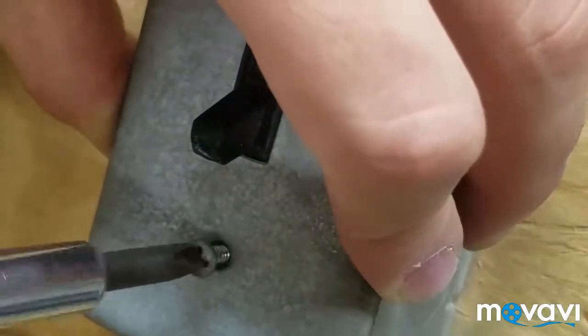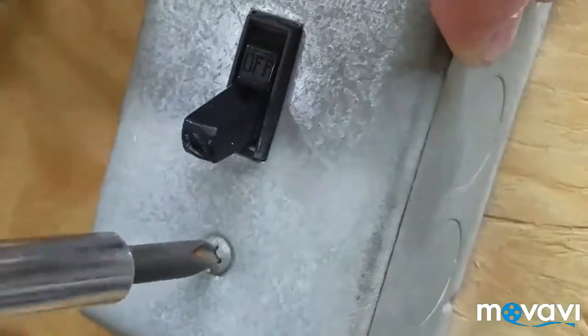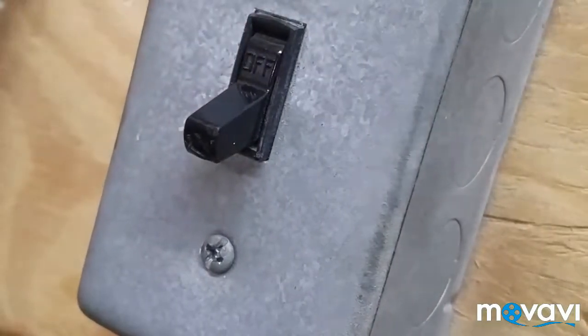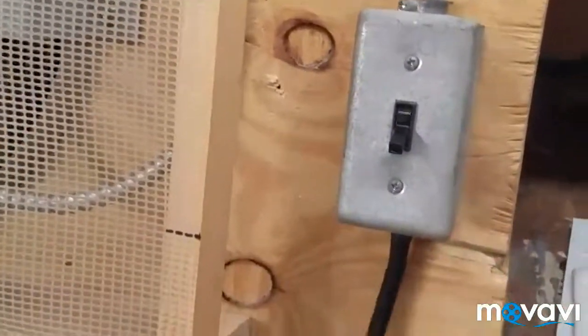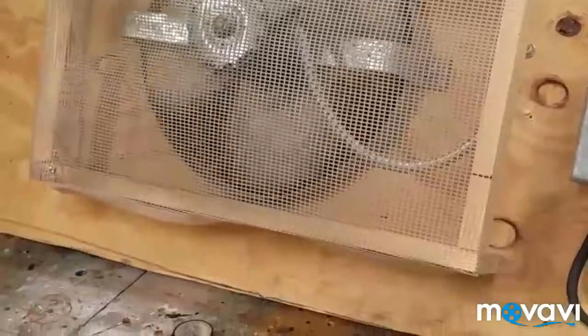The switch is back together. Now, plug her in — fire her up. Now we have power here, and there you go — it's running. Now it's off. So again, the switch is cutting the hot leg of the power and preventing it from starting. When I put the switch on, the contacts click in and allow power to flow through and go right to the fan motor to power the fan. That is how to wire a single-pole switch. Thank you for watching, and Mike out.